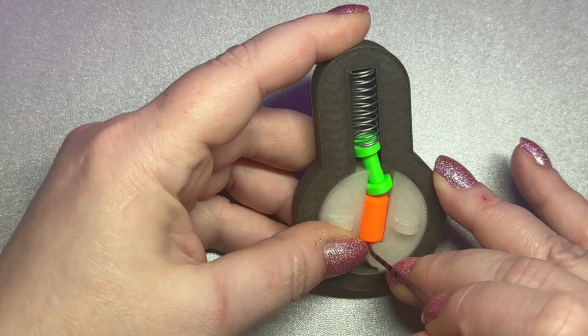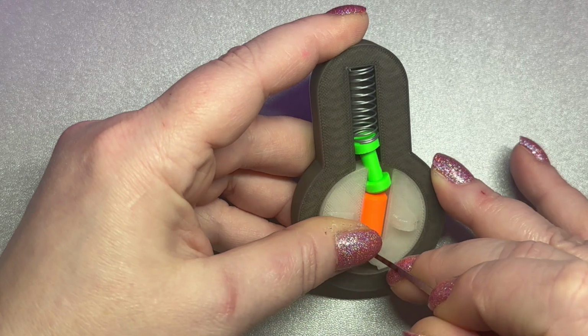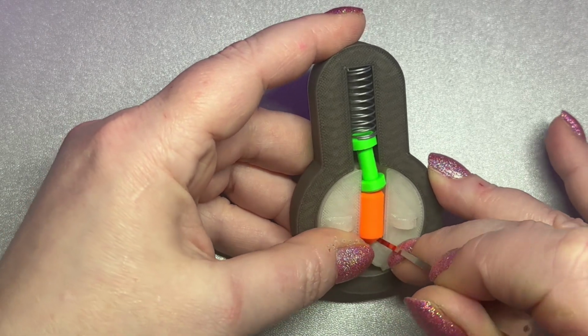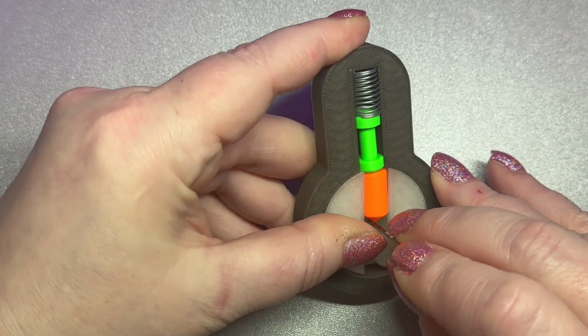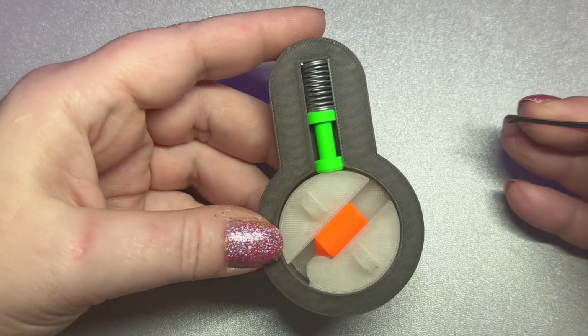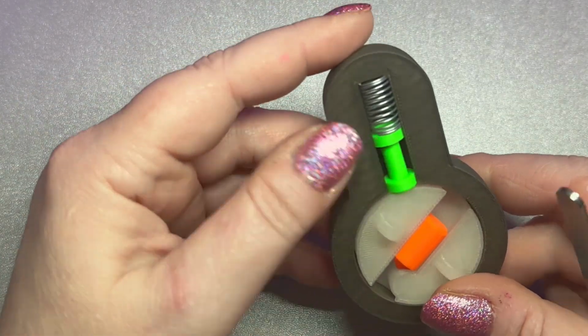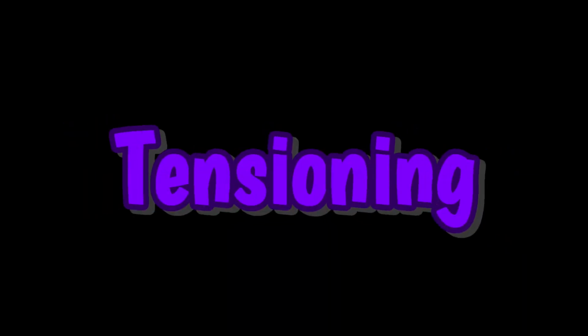It's because you're in the middle of a spool pin and you need to get the bottom of the spool pin up over the shear line, and it's going to counter rotate. What you're going to have to do is just continue to push up on that pin until you get that up over the shear line, and then your lock will open. Unless you have more spool pins, in which case that pin will set and the next one will bind and you'll be able to pick that one.